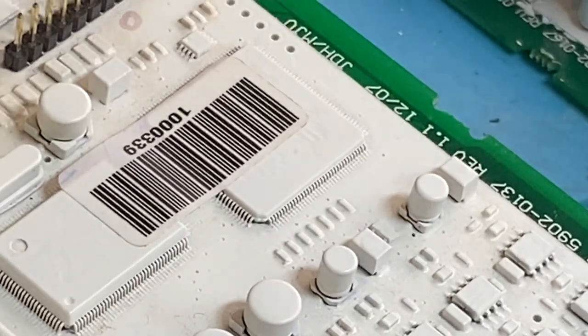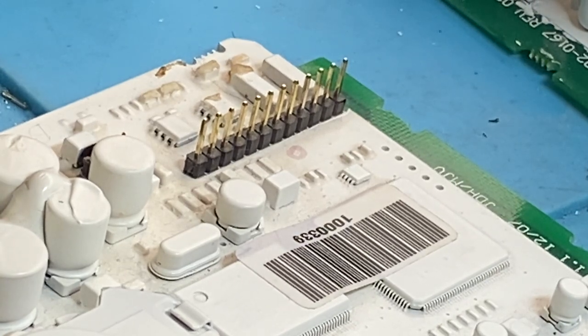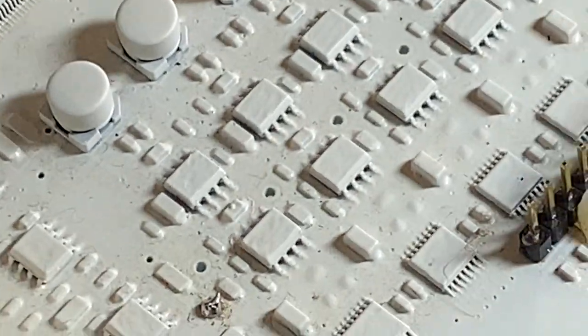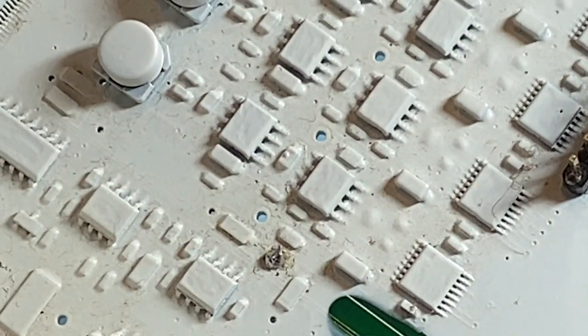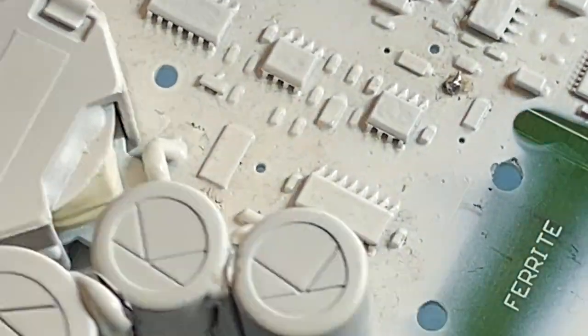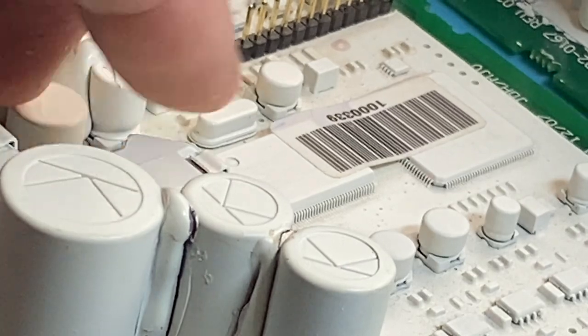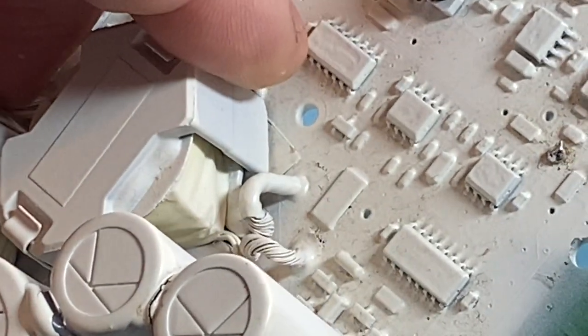If you've been out prospecting, you're probably out in the middle of the day detecting, and you'll find your detector is a hell of a lot noisier. First of all, the ground's getting hot. The ground is giving off noise. Your coil's getting hot. Your coil winding is getting hot, and its resistance is increasing, very small, but increasing, and your detector's getting hot. When you look at all those components, the added temperature through all of them will raise the noise figure, all in parallel and all in series. It's just one of those things. Go talk to Stefan Boltzmann about it. But he died many, many years ago. But these are the things we have to deal with.